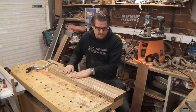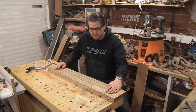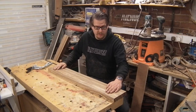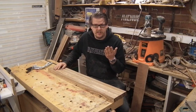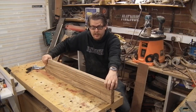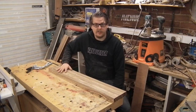We've got two nice flat parallel surfaces. The grain goes in every direction on this Zebrano so there's a little bit of tearout here and there — it's not perfect. I'm not quite happy enough to glue it straight up once it's cut down, but that's what hand tools are for. The next job is to clear off the table saw, square up these two faces and then run straight down the middle, which will give me a nice two-piece neck blank.